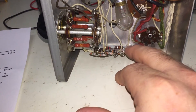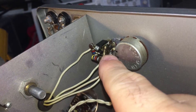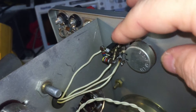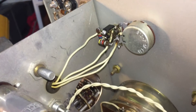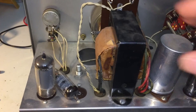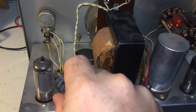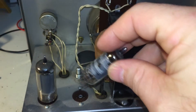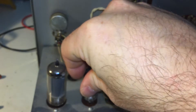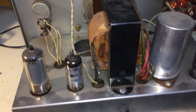I'm going to trace these wires back and see where they go. This wire branches off and comes through the toggle switch up front, so this extra wire may have come straight off here if not for that switch — it'll be a little harder to understand. I've now secured the transformer back into place with two screws. I've also taken the 6AU6 and straightened out the pins to the best of my ability. This tube should now go back in the socket. Does it work? I don't know — I'm going to have to put it on the tube tester.